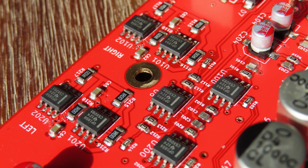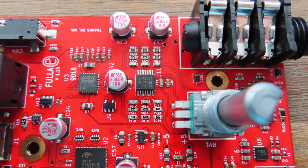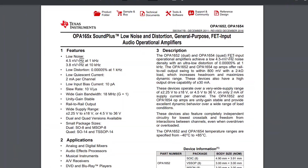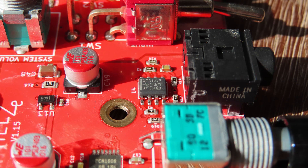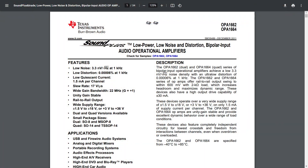When you compare the board of the Fulla to the Hel, you can see that there are 7 OPA1656s present in the Hel, whereas the Fulla only has a single OPA1654. The difference is that the OPA1654 is more of a general-purpose op-amp, whereas the OPA1656 is a Burr-Brown op-amp, which means slightly better quality. The Hel even has one additional op-amp which is used when you switch the high gain on, in the form of an OPA1662 by Texas Instruments.